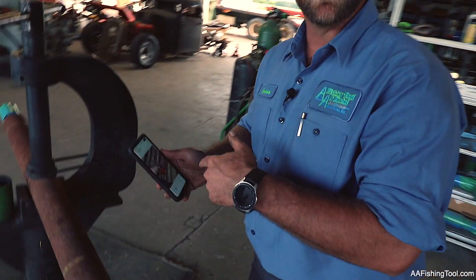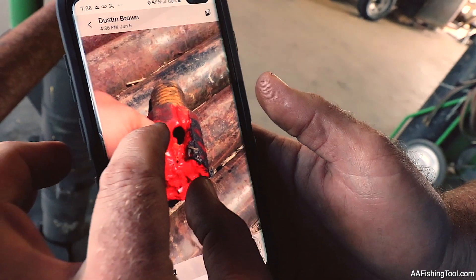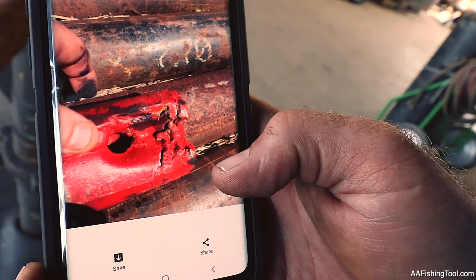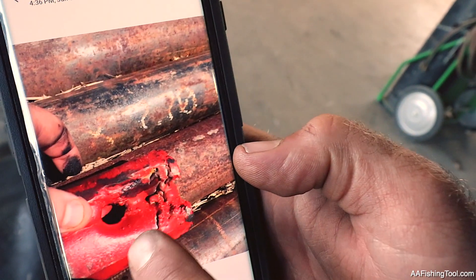We have a pump that can do those high rates, and I actually have a few pictures from our job this week where a guy chose to use a mill. They had cut right on the bottom, and it has little tiny holes — they were forcing all the cuttings up those holes, which took 1,300 psi. Those are actual pieces of rubber they drilled out of that well, and those fit through that tiny little hole. That's what pressure can do for you. If it was a smaller pump that could only go to 800 or 700 pounds, you would have been pulling out of the hole, digging the rubber out, then coming back the next day for another charge. With our pump, we just keep drilling and here comes the rubber — that's the difference between making it a one-day job or fighting it all week.